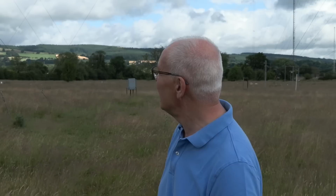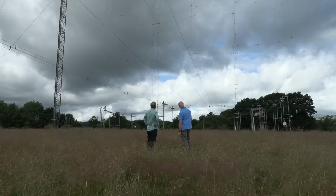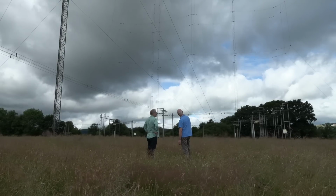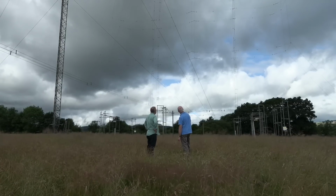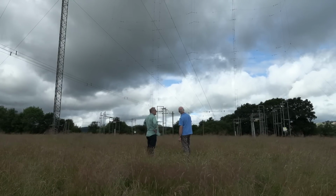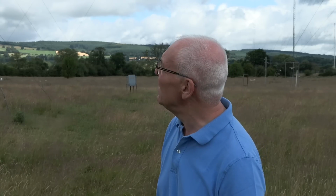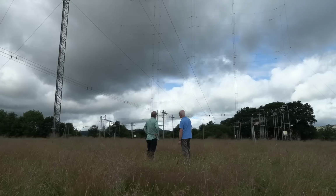And what does it consist of? We say it's a 17 megs antenna, but what sort of an antenna? It's 4 dipoles high, 4 dipoles wide, and it's a 17 megahertz array, so the RF comes in at the bottom, pops through up to the next set of dipoles with a phase change. The feeder twists all the way up to the top set of dipoles. And these are full-size dipoles. These are full-size dipoles and cut in the middle, so they're a high impedance feed as against the ones that we'd have at home that we use for 75 ohm feed. These are high impedance feed.